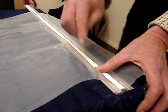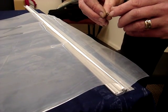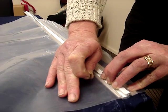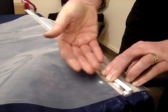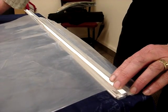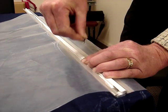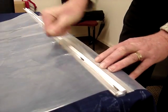The third part of the lock strip system is the lock strip clip. It has a long leg and a short leg — the long leg again faces towards the plastic film. We pull the insert back in the groove to make sure it's seated, then place a clip in. That's the fastening system finished. Continue putting the clip in approximately every six inches. For the next one, do the same thing — pull the insert back, and the long leg of the black clip goes under the front of the aluminium, and so on.